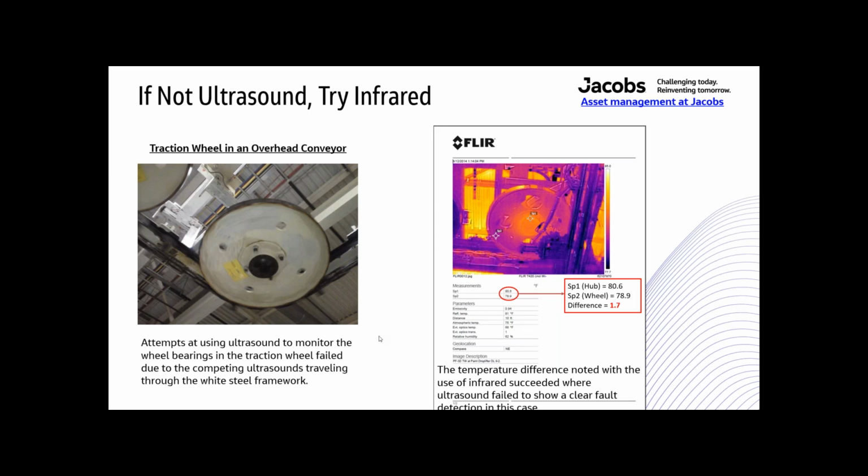They contain two opposing wheel bearings, upper and lower, that are packed with grease prior to installation, and there's no way to provide additional lubrication while the conveyors are operating. Basically, disassembly is required to repack the bearings. There's no way to lubricate the bearings, period, even if the wheel was stopped.